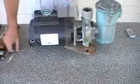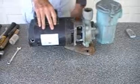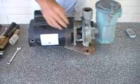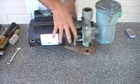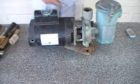First thing we're going to do, I like to loosen up the motor bolts first, just because when you are replacing the pump seal, the pipes are going to be there. The pump's going to be a lot more stable than this, but sometimes these bolts are seized up. With this stuff plumbed in here, if they're hard to turn or get off, it's just a lot easier to do when this is all attached together. So all I do is just loosen them up a little bit. They're loosened. We're going to go ahead and pull off the 1/2 inch ones.